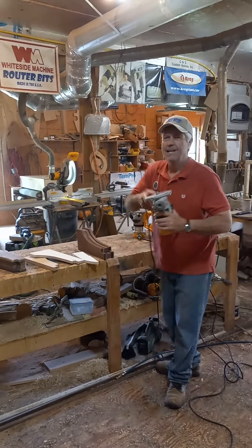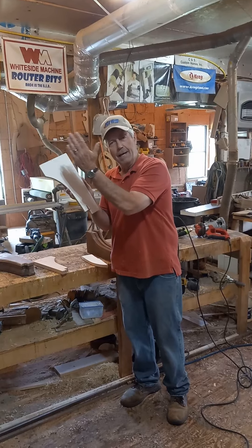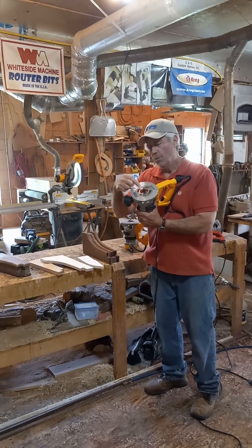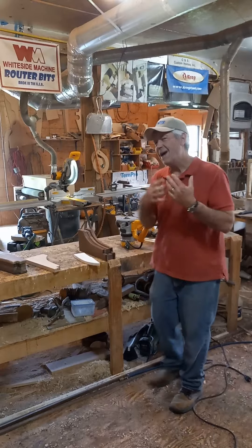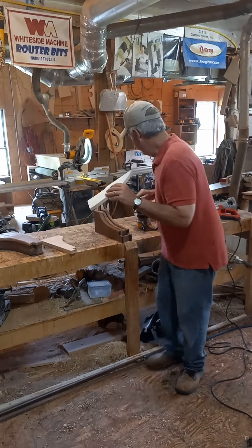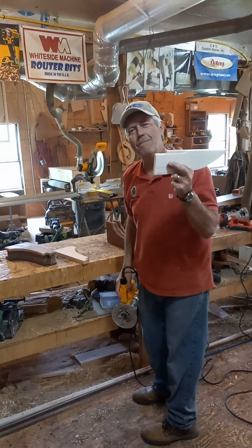So how did I get a pattern that exactly follows the outside but just steps back about a half an inch? Here's the secret. I took this rabbeting bit — a half-inch rabbeting bit — and first made an exact duplicate of this piece by tacking it to another piece of wood cut close to the profile with a jigsaw. Then I used a flush trim bit with the bearing riding on the original pattern to make an exact duplicate. But then to move that pattern back that half inch, I ran a half-inch rabbet around the whole curve, then came back with a flush trim bit. When the flush trim bit rides on that half-inch rabbet, you get a flush cut that moves it back exactly a half an inch.